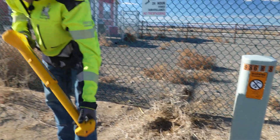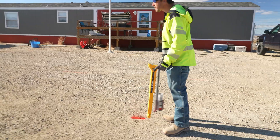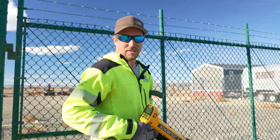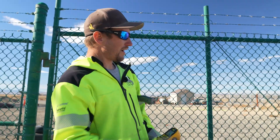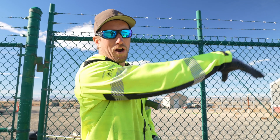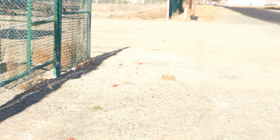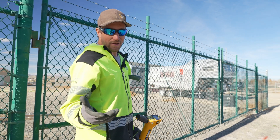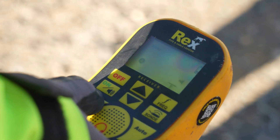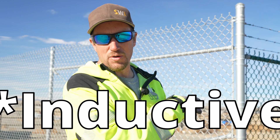Let's see what we can pick up. It says there's something right there. You've got to remember that we're doing this in inductive mode — there's nothing attached to that phone cable and it is just sending a signal magically through that phone pedestal down those wires. I've got a pretty straight shot. Looking back, I can see that would be my average of where my phone cable is going. I think that's a good locate. We can also double-check by pulling a depth measurement. It's telling me one inch when I push the depth button — I can track where that utility is, but when I'm in inductive mode, I can't quite get a depth on it.